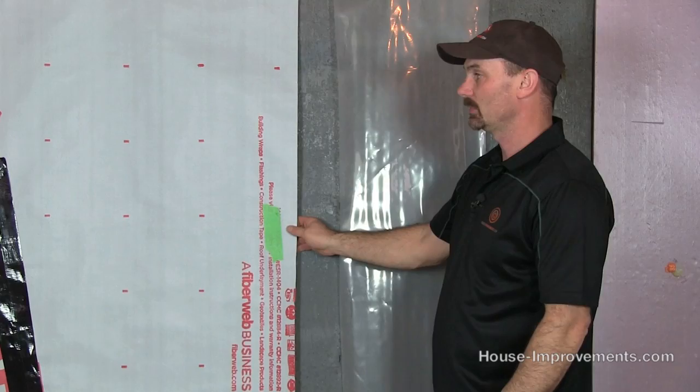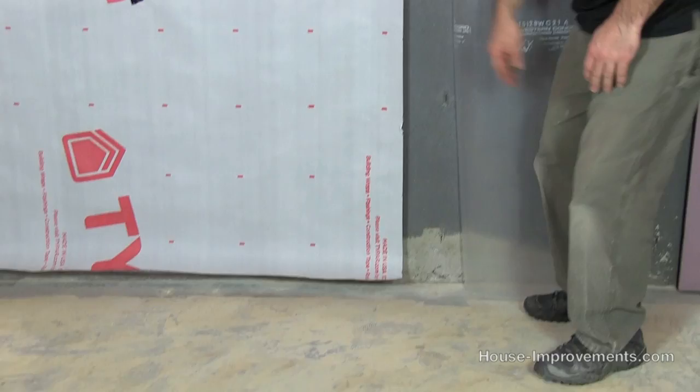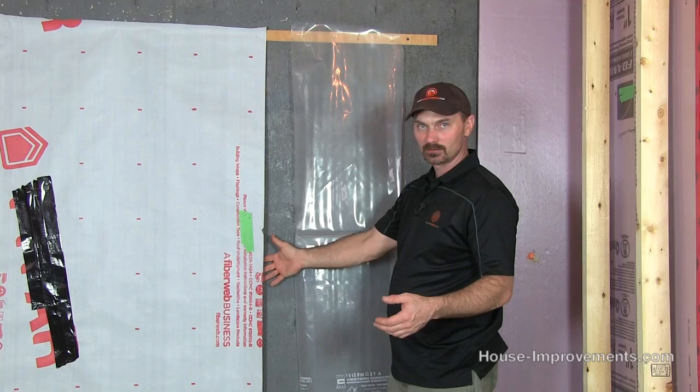The other product you could use would be a house wrap, like an exterior house wrap. Same idea — just get it stapled to the wood strip that's 12 inches above grade and hung down to the floor. Now with either one of these products, anywhere where you've got to overlap at a joint, overlap it by two feet. Don't tape it or anything, just overlap it. The idea is to direct the moisture down but also still allow the wall to breathe, because there's no insulation value to this.